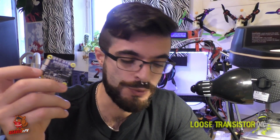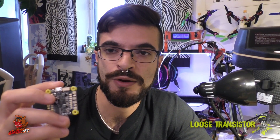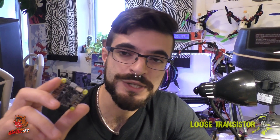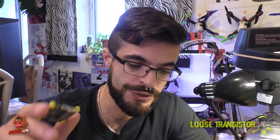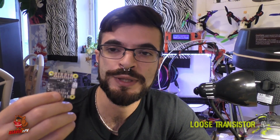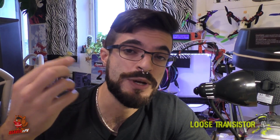Overall I highly recommend checking out the new CL Racing F4 V2. It's a great FC, and if it's an improvement on the already excellent V1 — which I believe it is — you're in for a treat. The boards fly great and are super easy to wire with well-labeled pads. Key new features over the V1 include: a 4-in-1 ESC connector port, a dedicated S.Bus inverter making Taranis telemetry easy, camera settings via the OSD, and a dedicated 5V/9V 2-amp BEC for both camera and VTX. My only gripe with the V1 was electrical noise on video, and I'm hoping the improved BEC and capacitor bank resolve that.